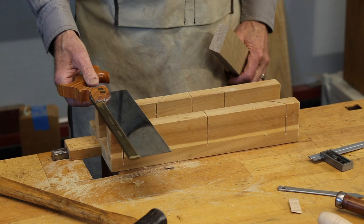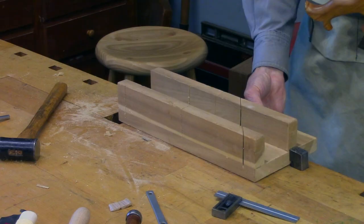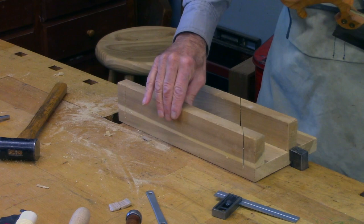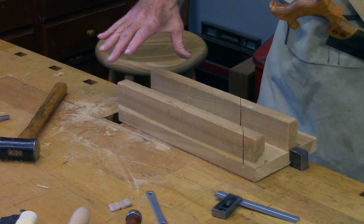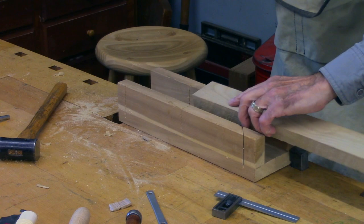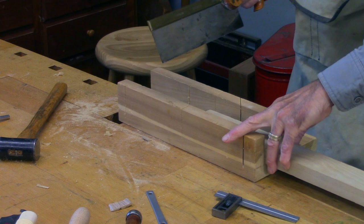Very simple tool. I took a piece of approximately 1 inch thick wood here, even a little better than that. And I glued two more blocks to it that are parallel. You just put something that's parallel in here and glue them in that way. And then I laid out 90 degrees, 45 degrees, 45 degrees. And to cut something nice and square, I can just put it right in here, take this little saw